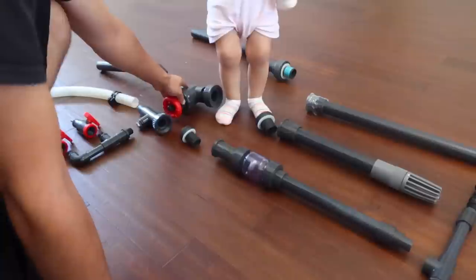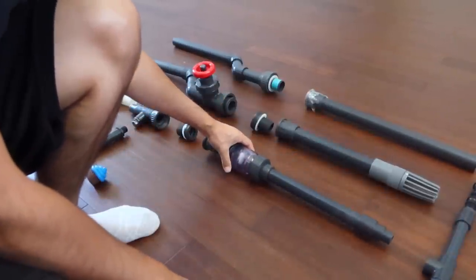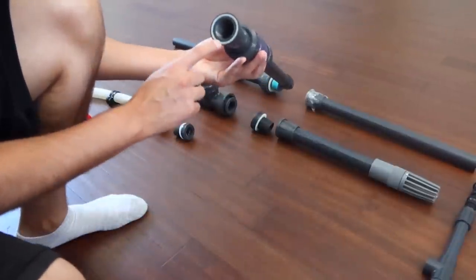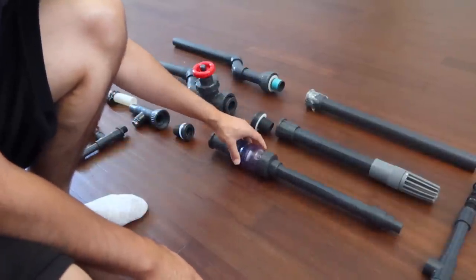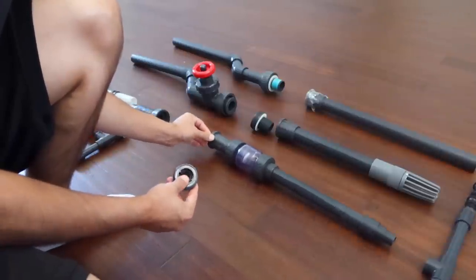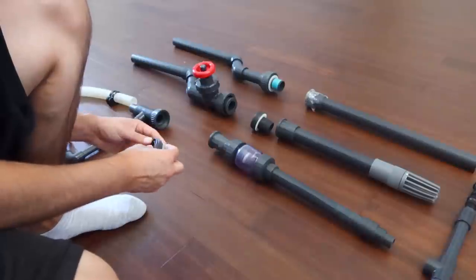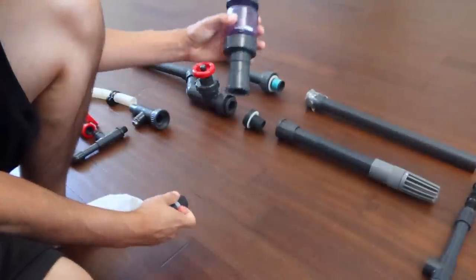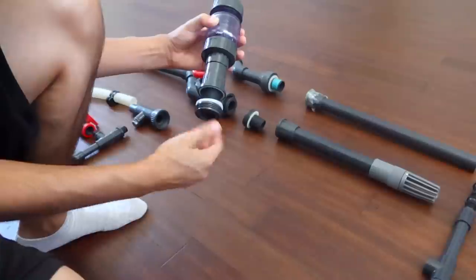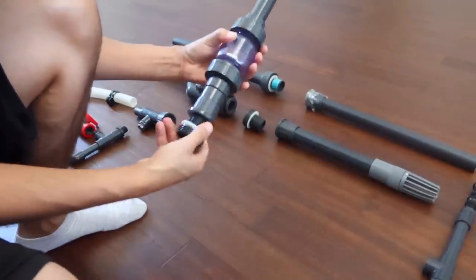Once assembled, make sure your o-rings are in place. Also check for the rubber spacers on the male fittings — the part that threads from the bottom of the tank through the glass. There's a rubber o-ring on the glass-side face and another on the male end coming from below, where the union attaches. If an o-ring needs to be there, make sure it is. A dry fit helps visualize it: the fitting comes in from the bottom, threads through the glass, and you don't want to over-tighten it or the rubber spacer may compress too much.